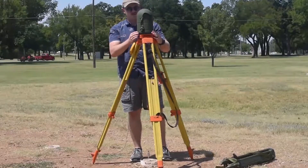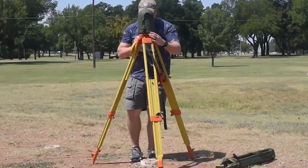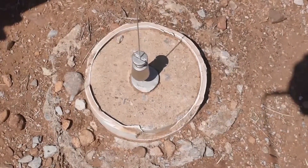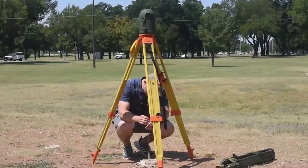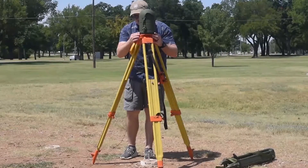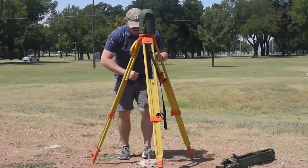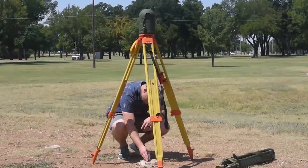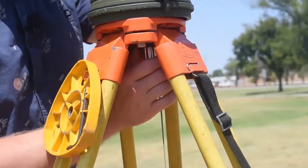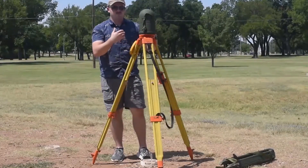This is also why we had to get within a half inch, because the instrument can move about an inch out of direction. This is how I get my fine plumb — looking at the plumb bob, I can literally move the instrument on top to get it directly over my point of aim. I can stop, get it nice and close, make very small fine adjustments. And once I'm there, I can tighten it down, take off my instrument's cover if it has one, and then begin the leveling process with that instrument.